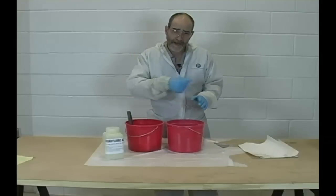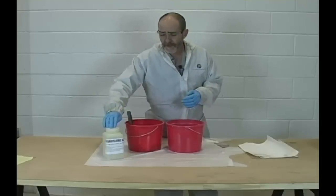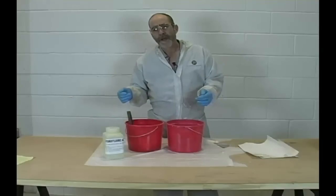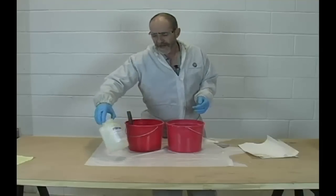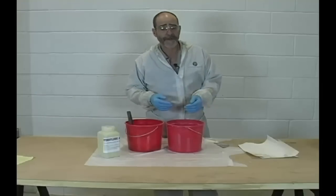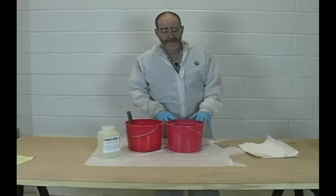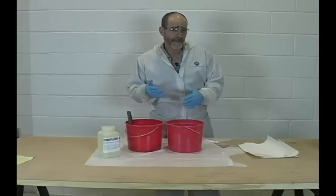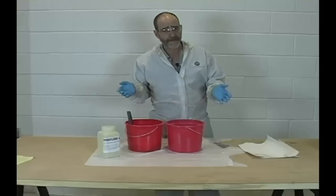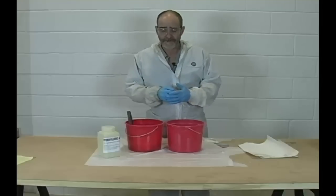Once we feel the drag forming, the tub is rinsed. We use about a cup and a half, so this will do probably four tubs — we use very little per job. The pH on this is like four and a half. Once it's rinsed and diluted with water — which it dilutes very easily with a couple to three or four gallons during the rinse — it's pretty well neutralized. If you have a septic field system and you're a little concerned, some baking soda could be added to counteract any pH imbalances. But the small volume that we use, I really don't feel like it's an issue.